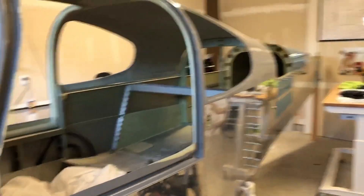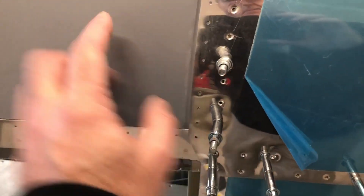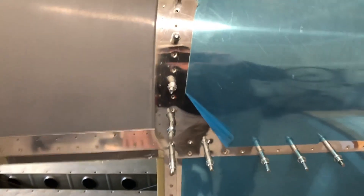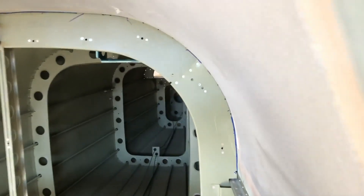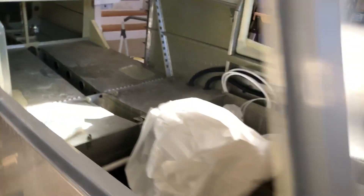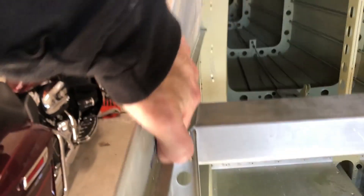It's starting to come together. December 26th again. Now what I've been doing is putting this final skin on here to test the fit. Right along here, you'll see there's a bit of a gap — that's because this piece is pushing back on the bulkhead, so I need to trim it back a little bit; it's a little wider than a quarter inch. And then on top, same problem right around here: it's pushing the bulkhead back to the point where you can't get a Clico in here, so I need to trim that back a bit.